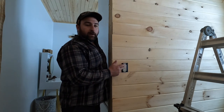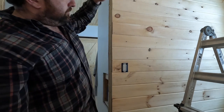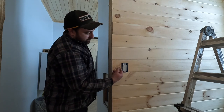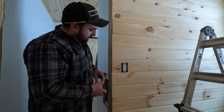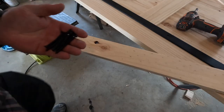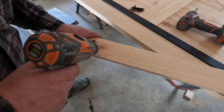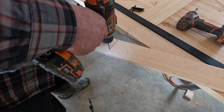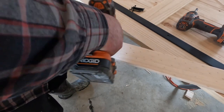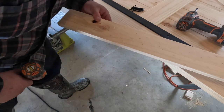I'm trying to make it so the door slides past the light switch so we can toggle the switch and then slide the door shut. The rail needs to be set further toward the outside wall. In my case I'm moving everything over a little bit so I can access this light switch. We're going to be using two-and-a-half inch Phillips head screws. Pre-drill with an eighth-inch drill bit — you don't want to split the wood.